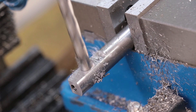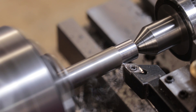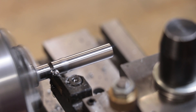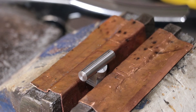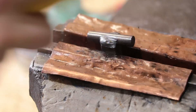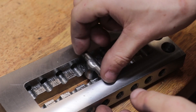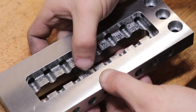I'll drill a hole in the part and then cut it off. I'll turn down a piece of steel and then weld it to the other part. In hindsight I could have brazed it in place to keep the buildup of material to a minimum, but this still works and the insert fits.